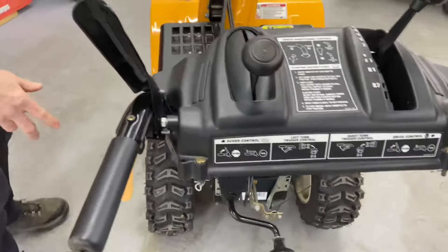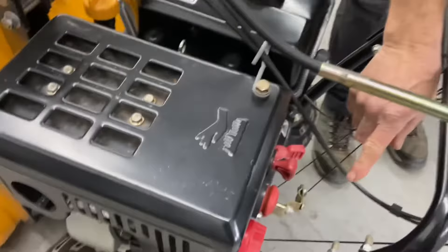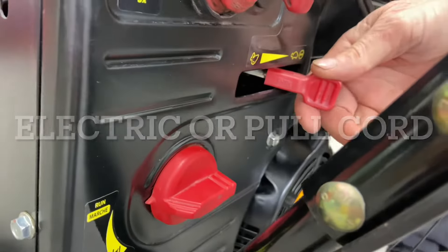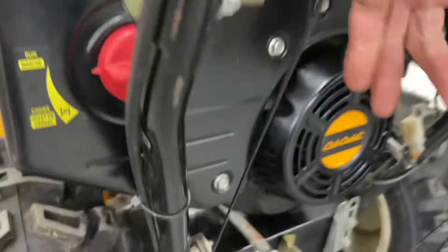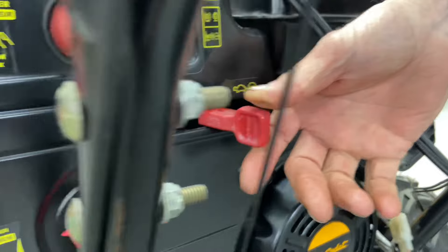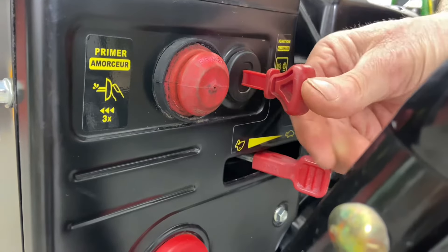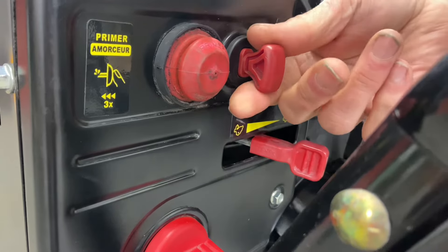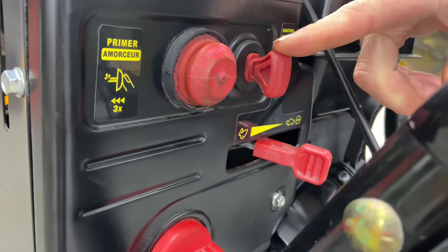As far as starting the machine, there are a couple of different ways — you can start it by electric or by pull cord. Down here we have all the controls. You have your throttle, which is here. If your throttle is all the way in the stop position, that is off — so it's like a switch. You want to put it at least at half throttle; I don't like to start them at full speed. This is an on/off switch also. This key must be in and snapped all the way in — I'd recommend drilling a hole through there, putting a piece of rope around it, and tying it to your handle so you can't lose it. That key must be in before it'll actually run.